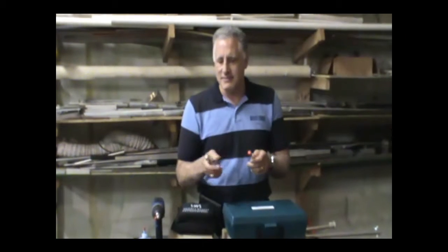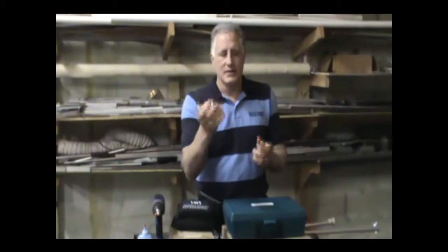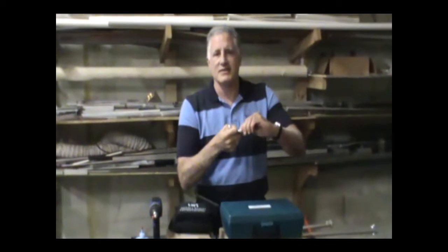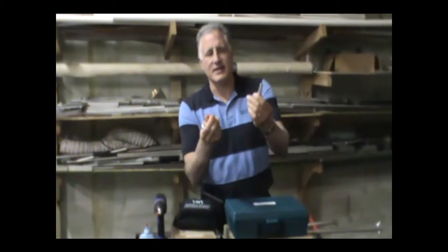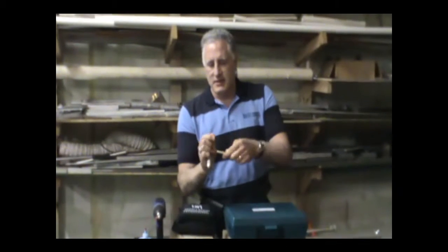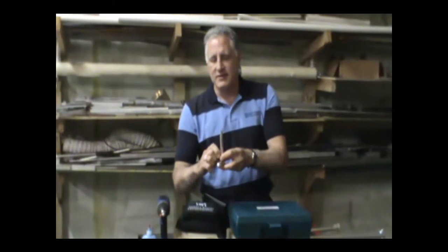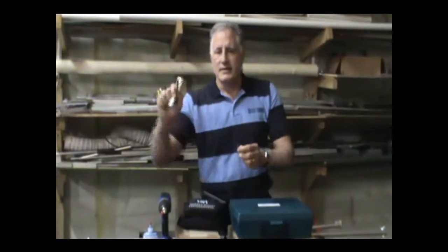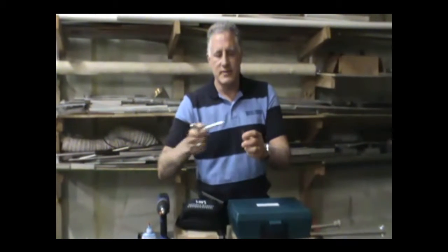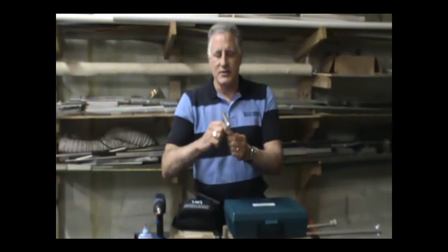It's a pretty simple little device, really. It's a combination of what we call the handle here and the cutter sleeves. In this case, the cutter sleeve is inside this plastic vial with an airtight cap. To take a sample of something that is a suspect asbestos-containing material, you put the individual cutter sleeve on the handle and core it into your material — any sort of soft material from roofing to drywall to plaster.